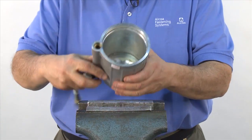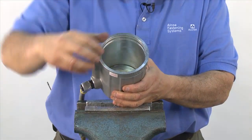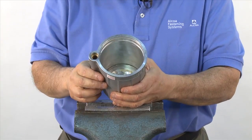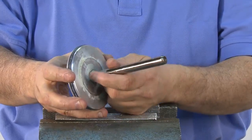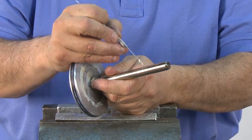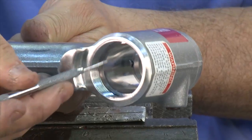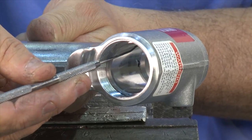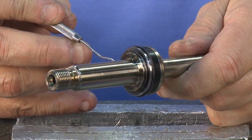This is a good time to inspect the inner workings of the 2025 tool. First, inspect the cylinder for scratches — if present, clean them up or replace the whole cylinder. Inspect the piston rod for visible scratches that you can feel with your hand or with a scribe. Also inspect the handle and interior cylinder bore, looking for scratches and anything you can feel with a scribe. Finally, inspect the pull piston for scores and scratching on the surface area.